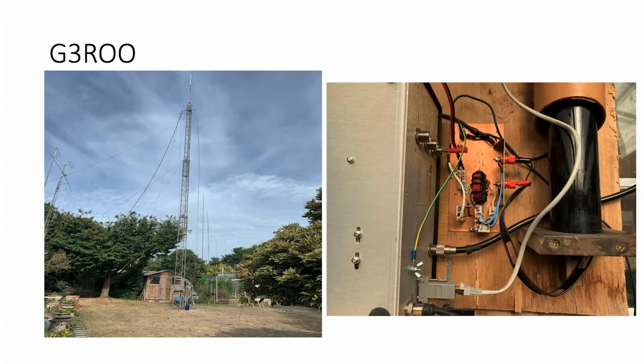By the way, we've left that aerial off the program, but to give you some idea of the versatility, on 160 meters, it's only usable on vertical polarization due to not being able to get a match on 160 meters as a doublet. Not that it will be much good. On 80 meters, it works beautifully as a doublet, really is a good DX antenna, as you might expect being so high above ground. That's 65 feet above ground at the center, and 75 feet at either end. On 40 meters, it can work on vertical or horizontal polarization, giving either DX capability or EU capability, if you think of it that way.